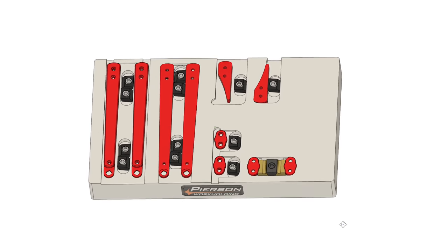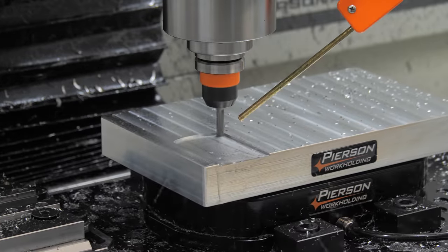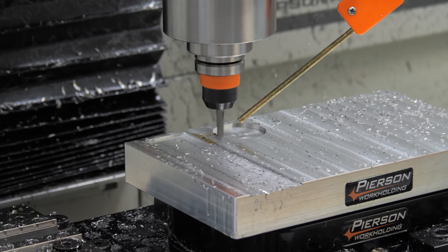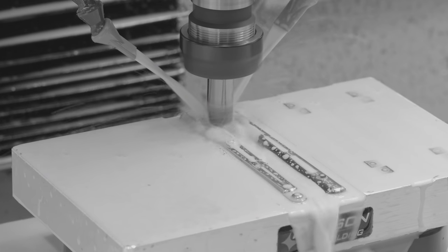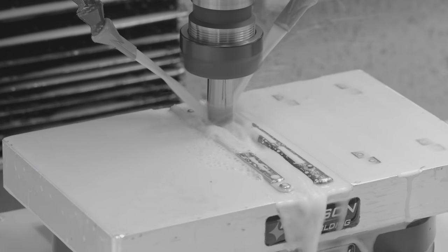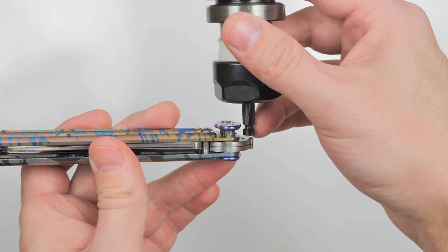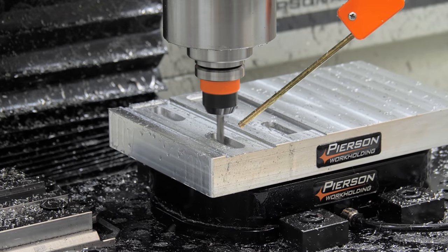I couldn't decide which parts in operation to put on a palette. Eventually I had to do something, so I made a palette with both ops for the handles, but I left space for other options. I wanted to make each handle in two ops instead of three. All of my titanium parts take three operations, basically because I wanted them to look cool, and I wanted to use form tools. The point of aluminum Baliscissors is either to make faster tests or to make a less expensive product. Less tools helps with that.